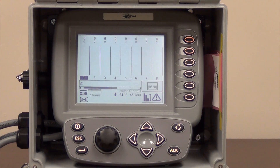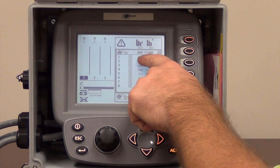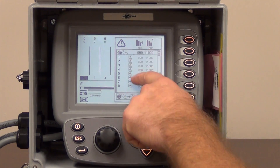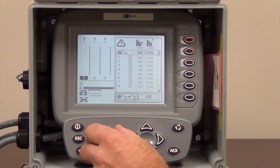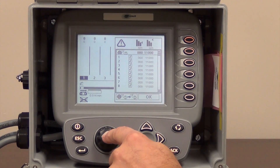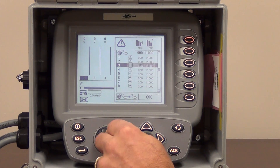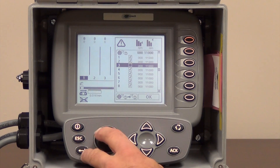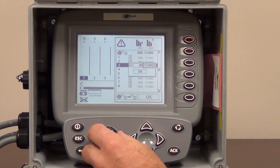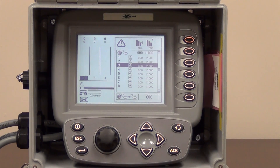We'll go up here and turn our logging back off. This next icon down here on the right hand side is just your alarms for your vibrators — you can set them. I always set them at 0 to 11,000. You can also ignore vibrators on this page too. If you want a vibrator to not record information and it's not plugged in, highlight the outside box, press your button, and let's say I want to ignore vibrator number 3 — turn my black knob and highlight number 3, take the check mark out, scroll around and hit OK. Number 3 vibrator is ignored. To put it back, just put the check mark back in there, highlight OK, and number 3 vibrator is active again.